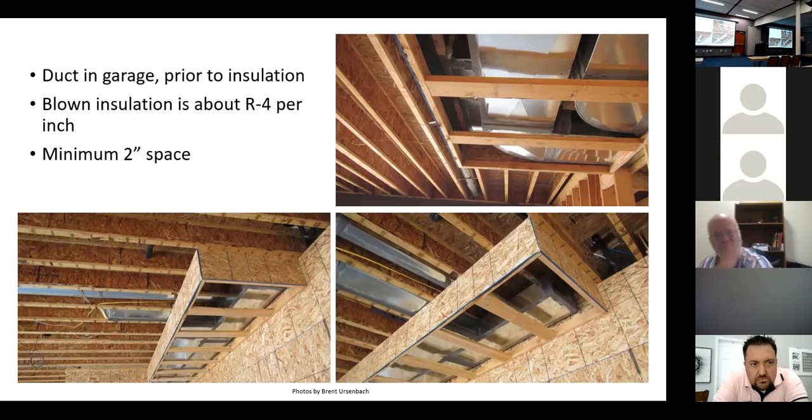But simply, you can send me an email, and I have the Air Duct Council's installation instructions, which all the manufacturers state is their specification for their duct. And it goes through everything they're supposed to be. Supported every 4 feet with no more than 1 inch of sag in 4 feet. Well, I don't think you can support it every 4 feet and keep the sag that low. You're probably going to have to support every 2 feet to keep the sag from being that much. I think it's a viable product if it's installed right. It's quiet and it's pre-insulated. So I see the value in trying to keep housing affordable, but it needs to be done better than it is.